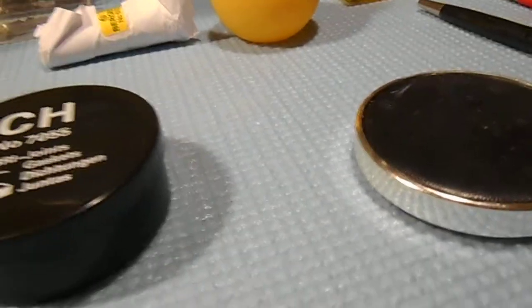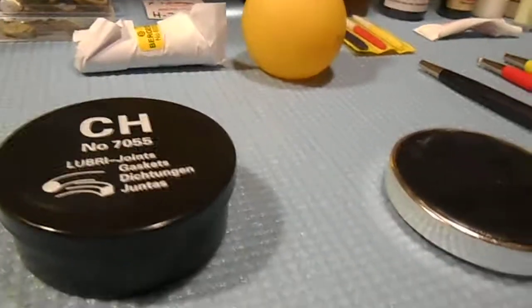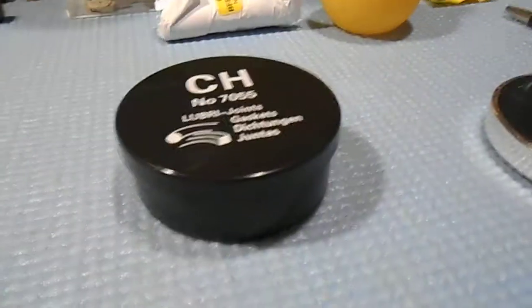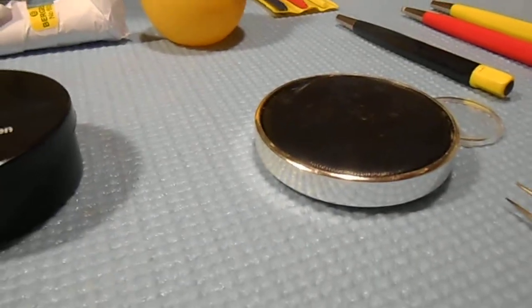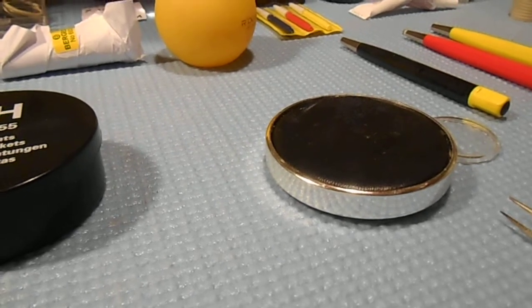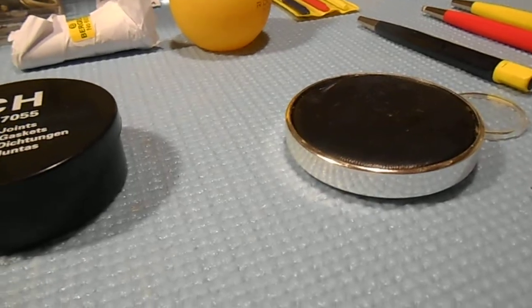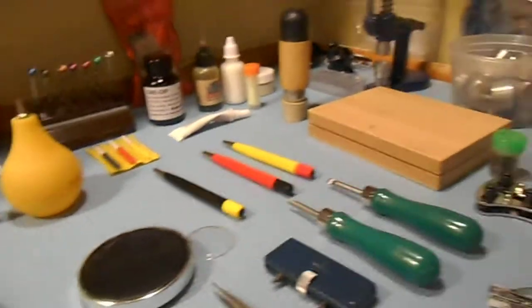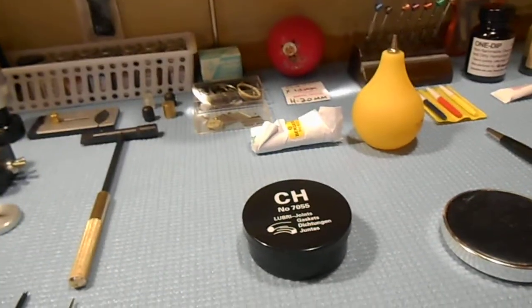The gasket needs to be lubricated. On my site I do this for every watch, but other places just get the watch and resell it. I get the watch, refurbish it, make sure it's top quality before I ship it. That O-ring is very important — when it's not done the O-ring will dry rot, water will get into your watch, and it'll destroy it. Your watch will be irreparable after that.